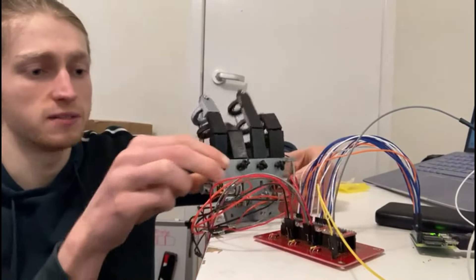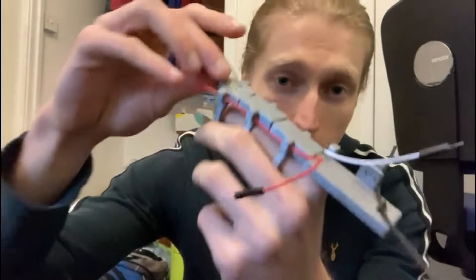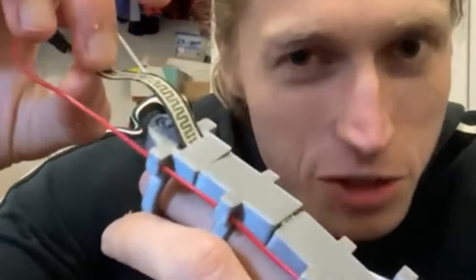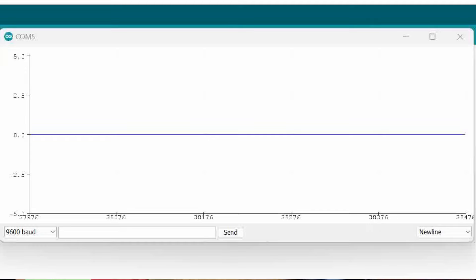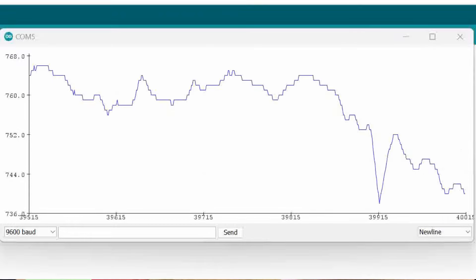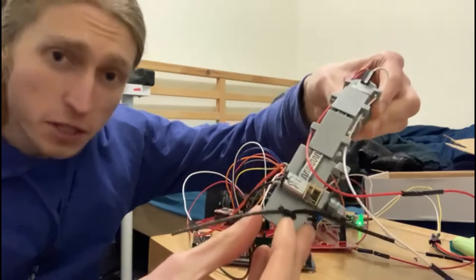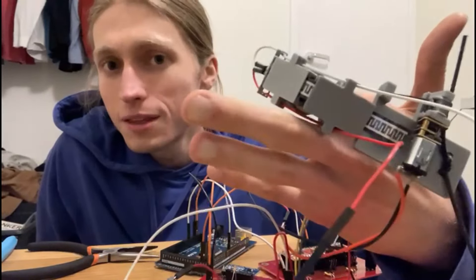If I just leave this to run for a little bit, all the fingers end up in entirely different positions, because the robot has absolutely no way of knowing where the tips of the fingers actually are. So I've whipped up this test rig, and what's different about it is there's a flex sensor integrated into the finger design — I'm pretty proud of it. The resistance of the sensor changes with bend: flat finger, no bend, no change in resistance, no reading. Move the finger, get a big bend, get a big reading, big change in resistance. We have a motor and it spins, connect that to the finger and the finger moves. Now we have this flex sensor that gives us an idea of finger position with motor spin — connect all those bits together and we can make a control system.